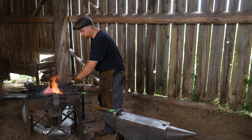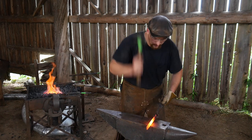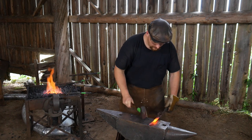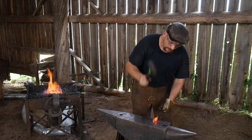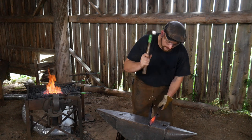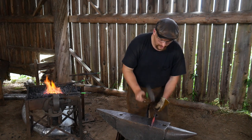This is up to temp now, or pretty close. We're going to start on the far side of the anvil — not the near side which is closest to you. We're going to pick a spot right about in there, just behind that area. Turn it a full 180 degrees, then come to the near side. You don't want to start right on it with half-on, half-off blows — you want to walk on to it, and keep it at a slight angle so we're not bending the piece.